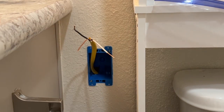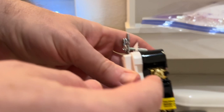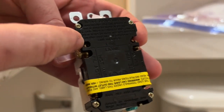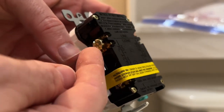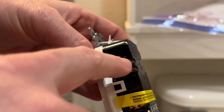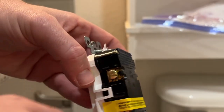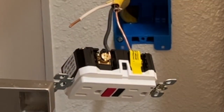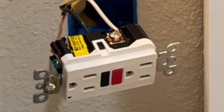I'm just trying to get it done at the house so he can get his bidet going. Remember, you always want to put the wire — you've got two U-channels on the screw — come from underneath on the gold side with the U-hook coming out this way. That way when you tighten it clockwise, it'll pull the cable in rather than pushing it out. We've got the ground done, nothing exposed. Let's get the white on — that looks amazing.